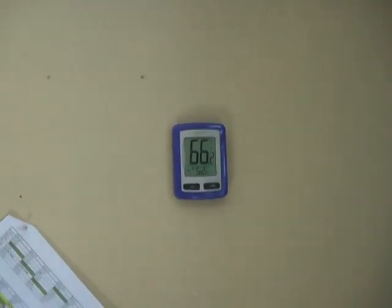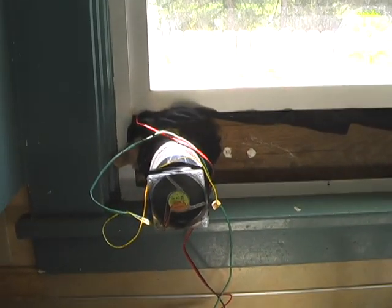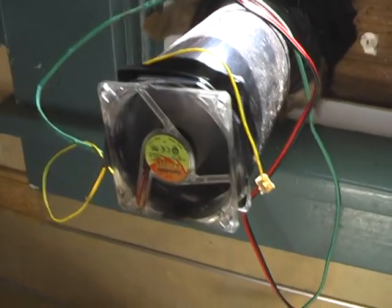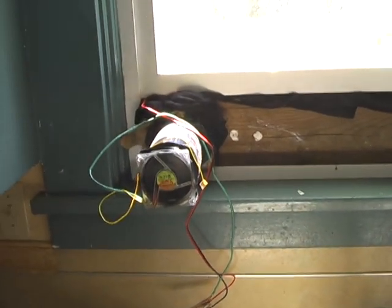It's 1:15 in the afternoon and the temperature of the kitchen has really stabilized — it's not increasing very much. So I went ahead and made a little change to see if we can get some more airflow. The small intake that was venting from the kitchen out to the solar furnace wasn't adequate. So I've decided to just put a vent on the bottom of the unit to allow the air to flow a little more freely. And already the fan is certainly producing more volume — it's moving a little quicker. I've just slightly opened up the window in the back side of the house.